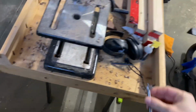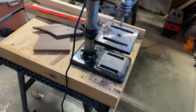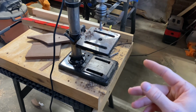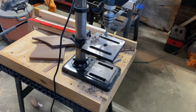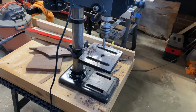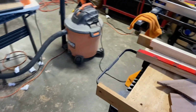It's actually pretty simple. As soon as you're doing any kind of drilling, or if you're using like your saw blades and it starts smoking, you need to clean your blade or whatever you're using to cut into the wood, because if it's smoking, you're either holding your tool in the same spot too long, or the tool is just blunt, like the blade has gone dull.